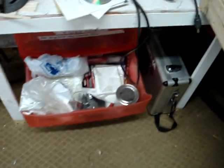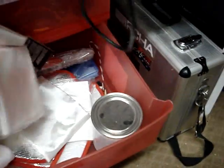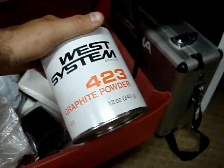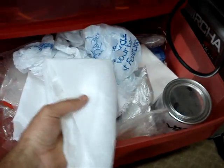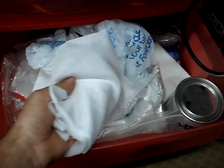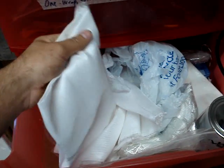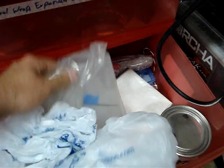You probably saw my little goodie box of stuff stashed down in here — just trying to keep everything organized. Scrap fiberglass, carbon fiber, some more fiberglass, some West Systems graphite powder — works pretty good for making some very slick surfacing coats with just regular resin. Then some cabosil in there to kind of thicken it up. This is actually 100% polyester cloth from Walmart, about 50 cents a yard — I use this as peel ply when I'm fiberglassing wings. It takes out all the hassle of having to do any sanding. Then I got some more fiberglass, some parts to my Eurosport that I still need to get put on there, and of course the G10 panels — just all kinds of little goodies down in there.